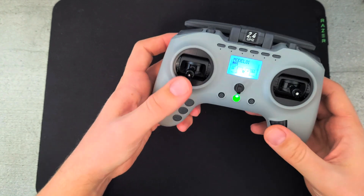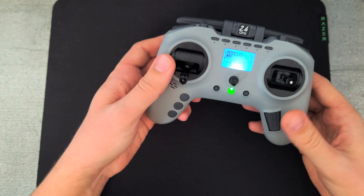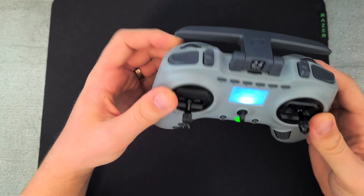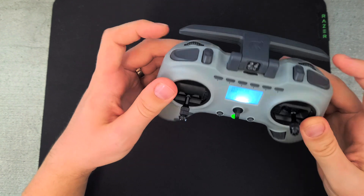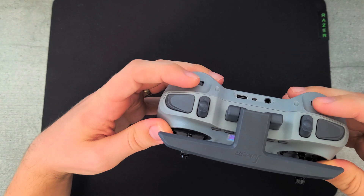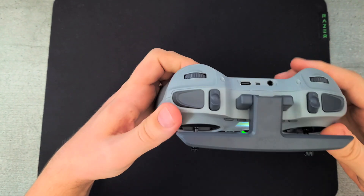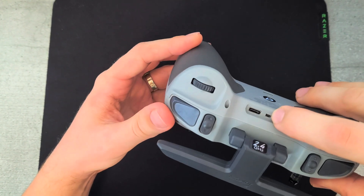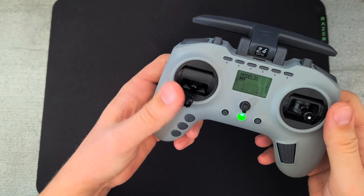The menu layout is quite nice — you've got everything you want, much more intuitive than on a T-Lite, with a roller and everything. For buttons, it has two three-position, one two momentary two-position, and two pots with a very small center detent, which is new on this model. It also has a boot button so you can easily get into the bootloader menu to flash your firmware.